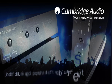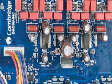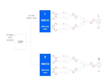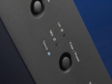Incredible technology leads to amazing results. DAC Magic sports a range of components you'd never imagine could be crammed into such a small box. These include dual-differential virtual earth-balanced filter topology and twin Wolfson WM8740 high-quality DACs, which operate in dual-differential mode for stunning stereo imaging. Meanwhile, a choice of digital filters, selectable from the front panel, gives you individual preference and flexibility.